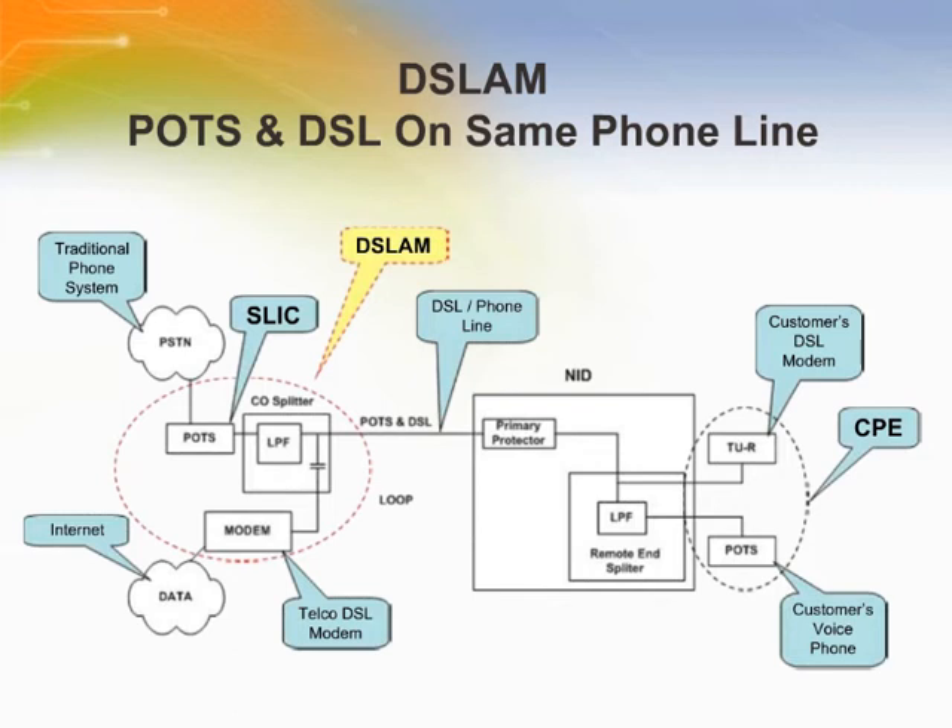This requires the OVP to break down above 300V. The Telelink fuse provides protection against power fault events, but it is specifically used not to open during induced lightning surges. This eliminates nuisance blowing while maintaining the ultimate protection needed for safety. It also provides overcurrent protection.